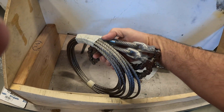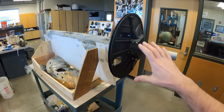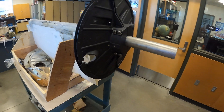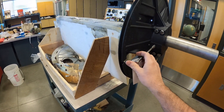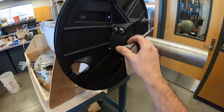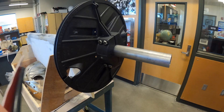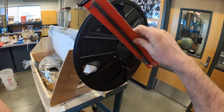We ordered new bolts, a new rudder stop, and a chain and cable kit — starting fresh. We want the steering to be as new and super reliable. That includes a new quadrant — check that out, it's beautiful. Unlike the old one, the new ones are powder coated and should last many, many years. There's the new long bolt. You have to drill the back hole to make sure it matches perfectly with your rudder stock, so we picked up a great big drill bit. Thanks for watching.